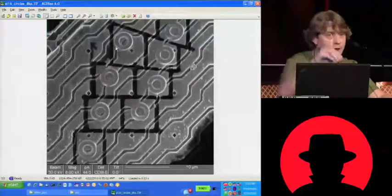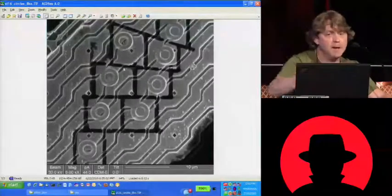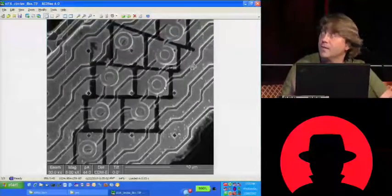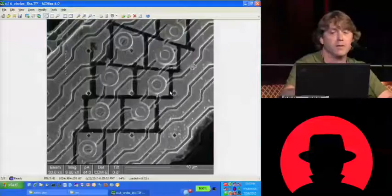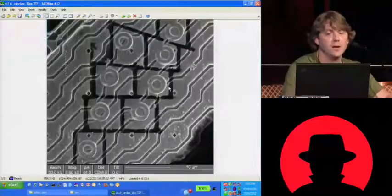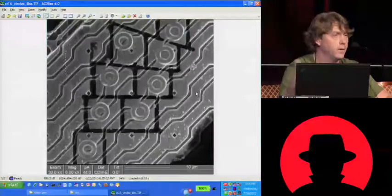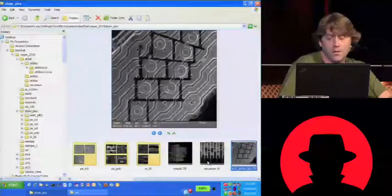So I drilled 8 vias down, touched metal 1, and then filled the via to the surface with platinum, and then made little donut rings in platinum as well. And so then I had to isolate them because these would have been shorted out. So then I used that same xenon difluoride gas, and I very carefully milled boxes around them. And it's black because it's an insulator again. The tungsten's been removed, and this is the oxide. Where here, this is like a spray can when I'm using the tungsten deposition. There's overspray always. So that was called a cleanup.